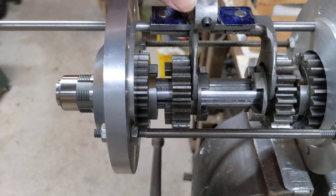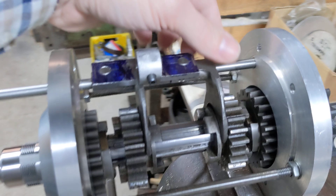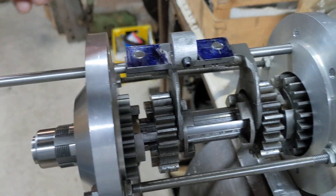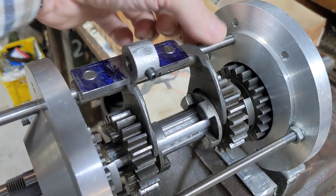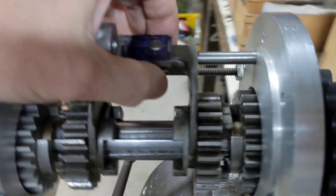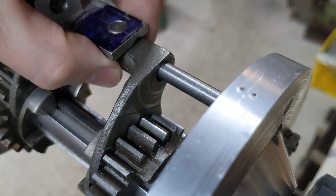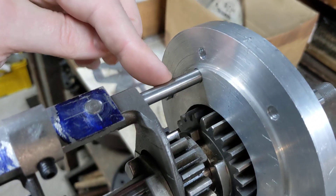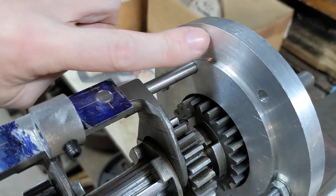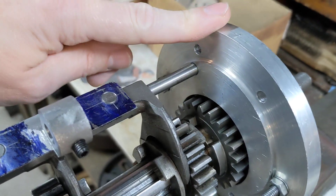As a proof of concept and a trial, you can see if the gears can be selected or everything locks up. This is an undersized piece of silver steel — for the pilot holes and lining things up that's fine, but in the final assembly this will be a nice snug fit with the gear selectors. This piece of silver steel is way undersized because we're going to put a thread on the silver steel of the right diameter, which means we've got to cut-tap this plate here, and if you go in with the right diameter there's nothing left to tap. That's why it's undersized for now.